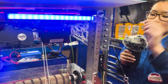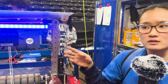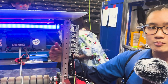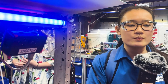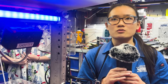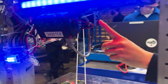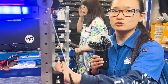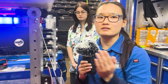We also have this limelight on the other side — this competition we're not using it, but we use it for AI detection with the notes, especially in auto. It uses a Google Coral — we don't have it on the robot right now, but we're planning on using it for state or later competitions. It picks up the note and our drivetrain rotates towards the note during auto to get as much accuracy picking it up. We also have adjustable limelight holders so we can figure out the correct positioning first, and once that's locked in we set the final angle.